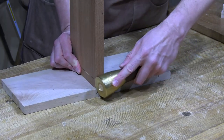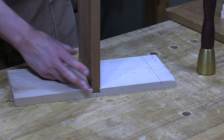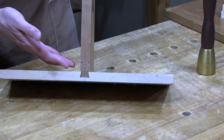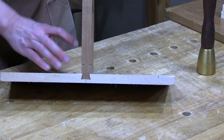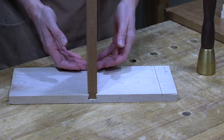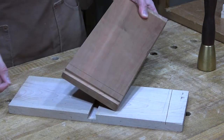Here's a little trick I do with the tapered dovetail: I will often leave the socket board a little bit wide. Once I get a really snug fit, I can come back and plane it flush. You can see how this is really tight and pulled up tight, but it's a little bit recessed of the surface. Leaving either the tail or the socket board a little bit wide of finished dimensions really ensures you get a nice flush fit on the front. Once I break it loose, it slides apart real easily.